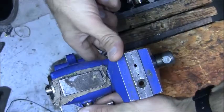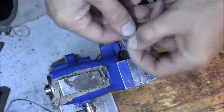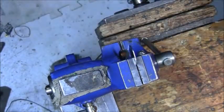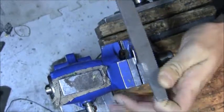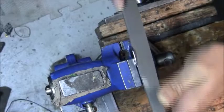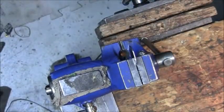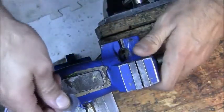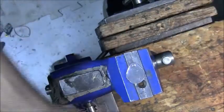The next step — I'm going to use the other side of the vise for this. It has two jaws on it, these are smooth. You locate that dimple, put it in the other side of the vise like this, and you file off just the dimple. The dimple sticks up so you'll be able to file it mostly without following the cut. I scratched a little bit, but now I'm going to do the punch the same way on the same side again.